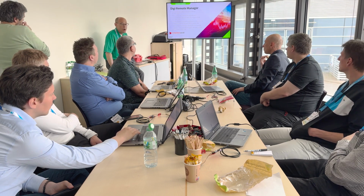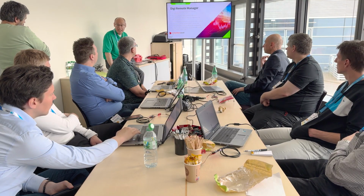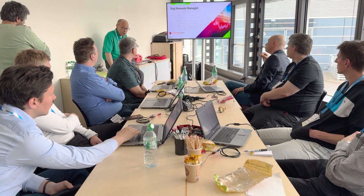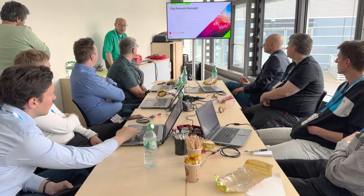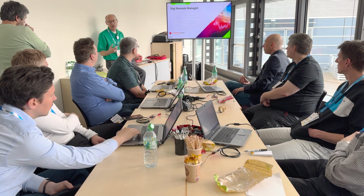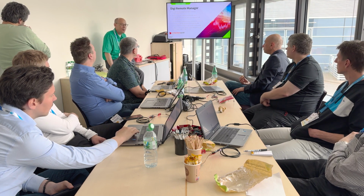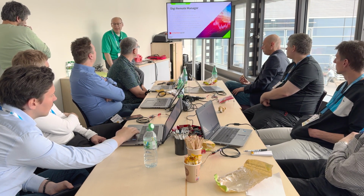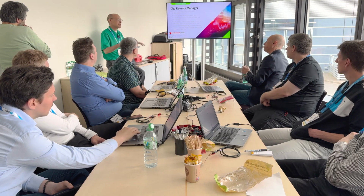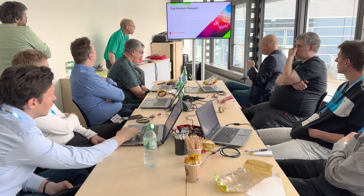Other important features, remote firmware updates, which I think are really a vital feature. Digi Remote Manager also has support for data streams. And you can think of this as kind of a light way of acquiring your data. So it's very easy to pass the data up to Digi Remote Manager. And that data shows up in a data stream, which we'll look at today through the interface, but mostly you would grab the data using an API, bring it to your own system, and process it there for whatever you want. It is not a complete data management system with statistical packages and complete dashboard building or anything like that. It's a relatively simple system with everything you need to pass IoT data up to the cloud and not worry about it after that. We talked about the scripting, so I think we're all set there.